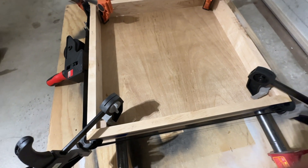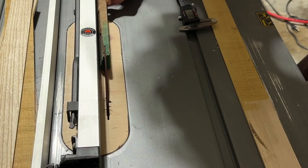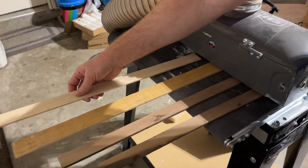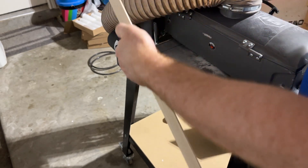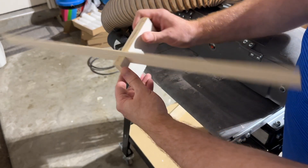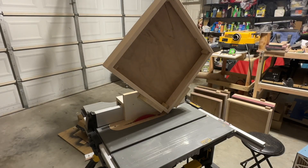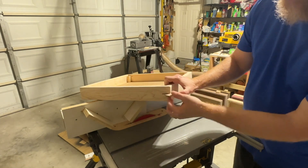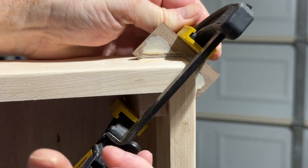I cut four 1-inch pillars for the inside corners and glued up the base using clamps to hold all the pieces together. While the base was drying, I cut some narrow strips of walnut and ran them through the drum sander. These were going to be used as spline joints to secure the base and add a little color accent. With an extra piece of plywood, I cut a groove showing the exact width of my table saw blade to determine the width of my splines, and tested the pieces after going through the drum sander. Once they were the correct width, I cut them into small squares to ready them as splines. I then used a jig I made to hold the chessboard base at 45 degrees so I could cut the grooves for the spline — a 1-inch deep groove into each of the four corners. I then added the spline with a generous amount of wood glue and clamped it into place to let it dry overnight.